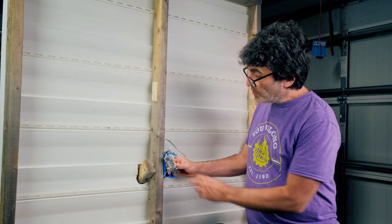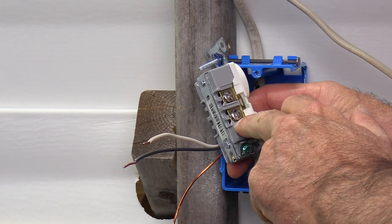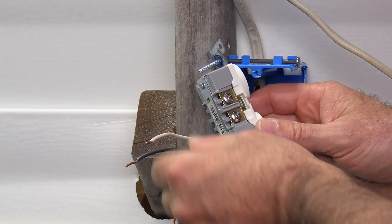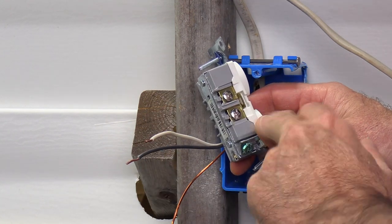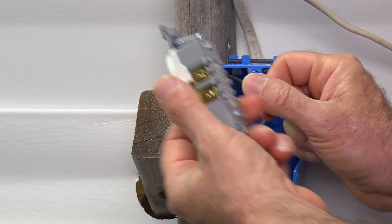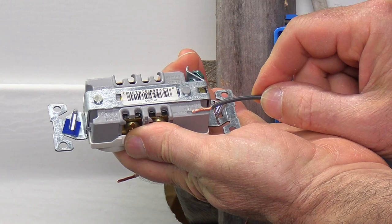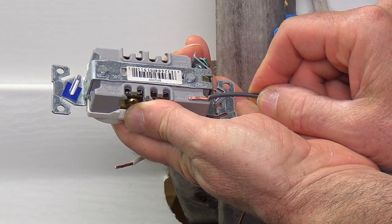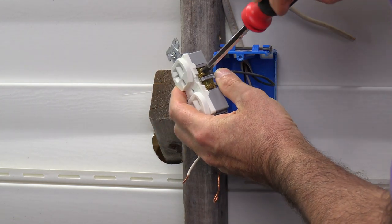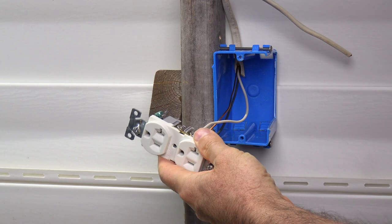Number one brings me into number two. There is actually a time where you want the wire coming out of the back of the outlet. This is a commercial style outlet that uses clamps instead of just screws like the previous one. You don't want to loop the wires around the screws like the previous example. Instead, you do want to use these clamps. The hot wire, the black, goes to your gold screws. Use the strip gauge on the back of the outlet as a guideline for how far to strip it back, then put it in the clamp and tighten it down. Your neutral goes to the silver screws, and your ground goes to the green screw.